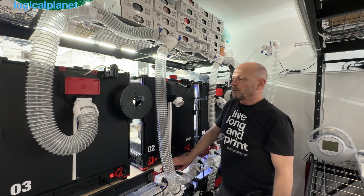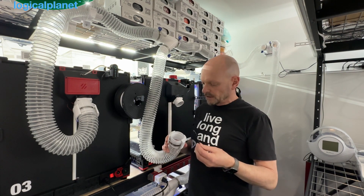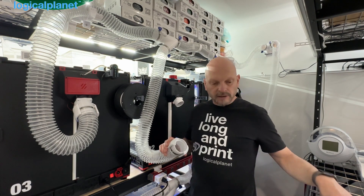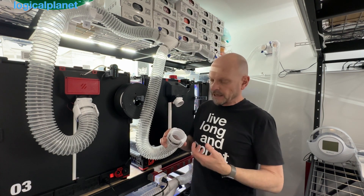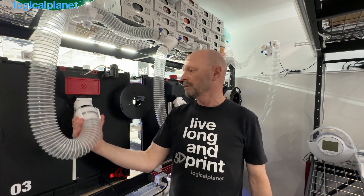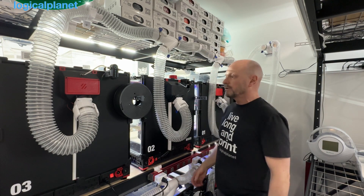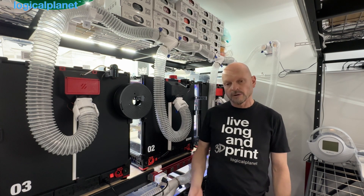The whole system works super well. The one optional element is a small gasket I designed, printed in TPU, that goes into the head so when a part goes on it closes up the end and creates a better seal. I'm not using it here because the seal is already great — just enough clearance to rotate with no meaningful leakage. I did put one on another connection just to test, and it probably is better, but it's not necessary. It's there if you want it. Really good system — super happy with it. If you have any feedback, please let me know.